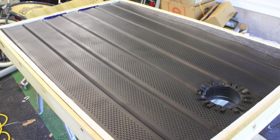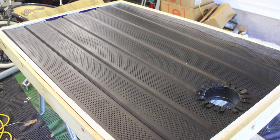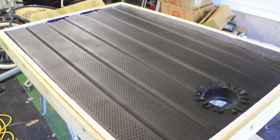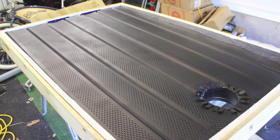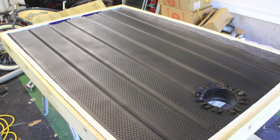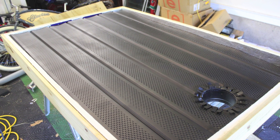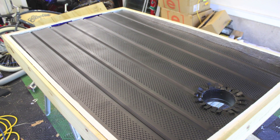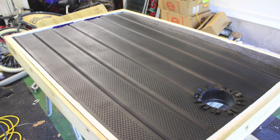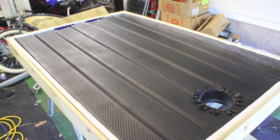Here's another view with the soffit material in the box without the glass on top. The air from inside the house comes through the hole at the bottom, runs across on top of the soffit material, pushes through the holes, and then goes out the back hole. This is the reason for the angled piece of wood I spoke about earlier — it gives us more air space at the bottom where cold air comes in, but at the top where the air is really hot, there's a bigger space behind the soffit material, keeping it away from the glazing.